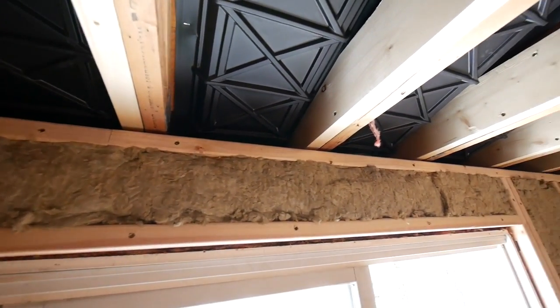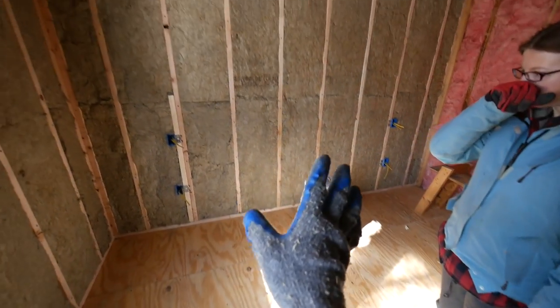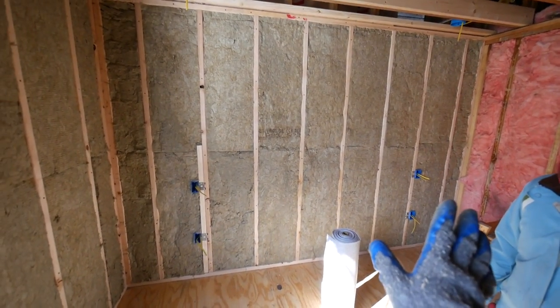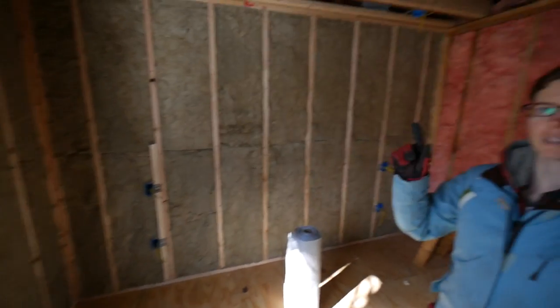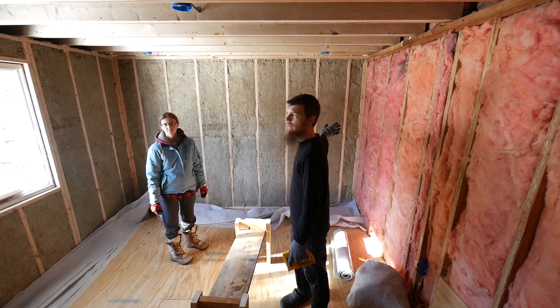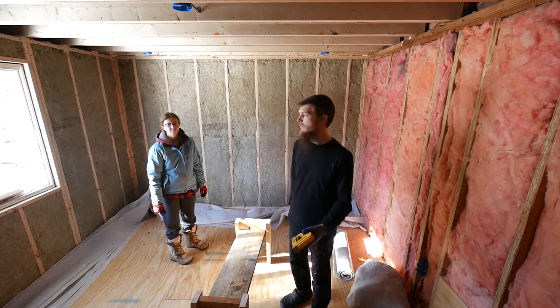Now that all the insulation is done, Ashley came in, inspected it, and gave it the okay. She showed me how to fix the spot above the window — I was going to buy a two inch foam board and she said why not just put the insulation up there, it's basic and easy. She added: Doug always likes to overcomplicate things and I have to be the one who says just do it the normal easy way. Now she's going to help me get the vapor barrier on the walls. This is a six mil plastic sheeting and we're just going to staple it up on the exterior walls — not the interior wall, just here and here — and then the ceiling.